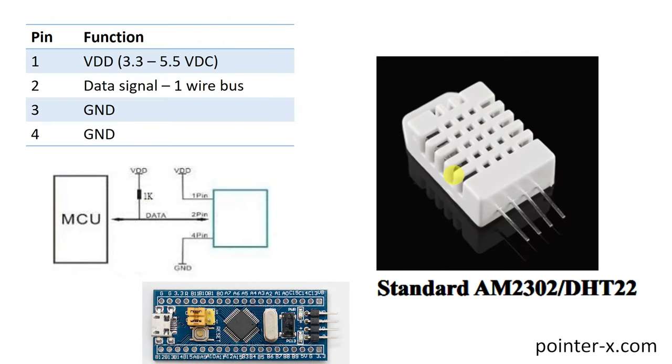This is an advanced tutorial on hardware implementation of the one-wire interface for the DHT22 with two timers and two DMA channels on the STM32F103C8. This MCU does not have a dedicated peripheral for the one-wire interface, but you can implement it with timer and DMA. DHT22 pin 1 is VCC (3.3 to 5.5V) and pin 2 is the data pin.